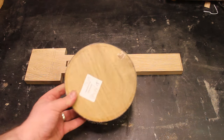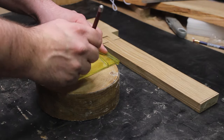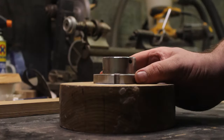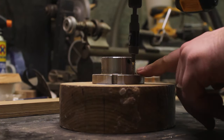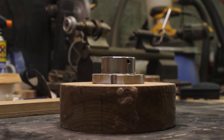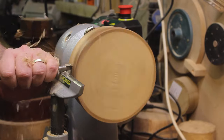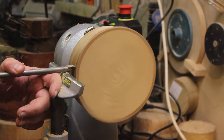In order to make a base for this lamp I'm going to be using this oak turning blank that I got from Yandals. Again, you could just cut out a circle of wood from something — it doesn't need to be turned on a lathe. Here I'm using the centre finder just to mark up the centre so that I can attach the faceplate and put this onto my lathe and round it out. The first step once it's attached onto the lathe is just to true up the blank — make sure that it's actually circular around the point that I ended up with as the centre.